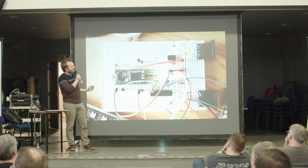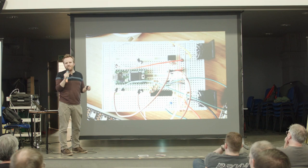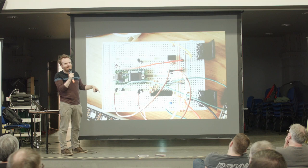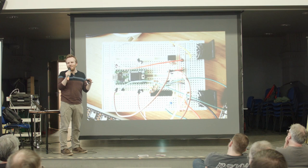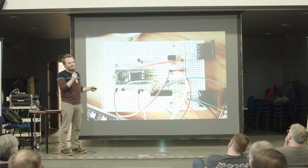Coming back to the electronics, I haven't really talked about the electronics, but it's a Teensy, just like in my laser gun, it's a little Teensy there. I love Teensies. I had some help from my friend Jason Hotchkiss, who makes lots of MIDI things, and they're all on Tindie. You should definitely look it up. But he helped me figure out how to make a MIDI interface, which is ridiculously easy, absolutely so easy to make a MIDI interface out of an Arduino or a Teensy. So you can see MIDI inputs and outputs there. There's a logic level shifter there and an opto-isolator for the MIDI input, which you don't strictly need, but you should do it.